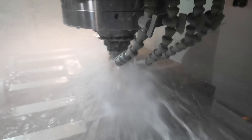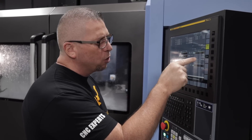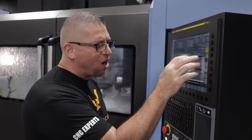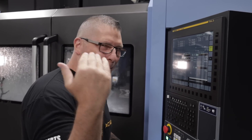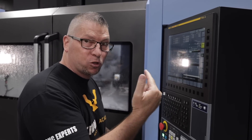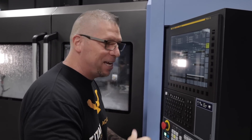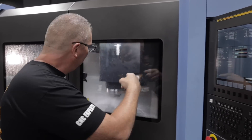You hear that? That's a crazy cut in 6Al-4V titanium — a half-inch radial, two inches deep. Look at the spindle load — we're right there at 40 to 45, right in the middle. That is perfect, and it actually shows me I can push this way harder than this, and we're going to do that. It's going to be amazing — check this out, come over here.